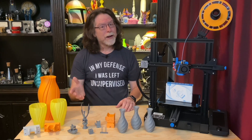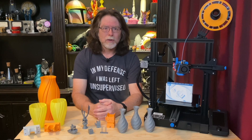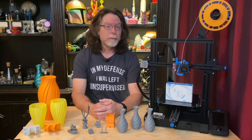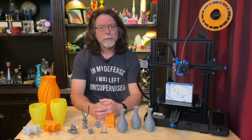I've said this was a DIY kit, and frankly it was a little more DIY than I was expecting. Because this can be mounted on many different makes and models of printers in many different ways, there really aren't any step-by-step installation instructions. You need a good idea of how a direct drive extruder should be connected and a good sense of how the X carriage on your printer works. I ran into a couple of issues — for instance, the printable Ender 3 V2 mount makes use of a couple of threaded mounting holes on the X carriage, but my very early production Ender 3 V2's X carriage doesn't have the same hole pattern as later ones. In fact, it only had one of the two holes needed, and that hole wasn't threaded and was too large a diameter for an M3 bolt.